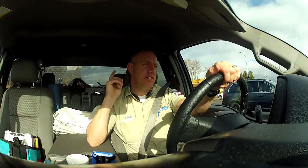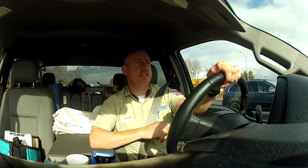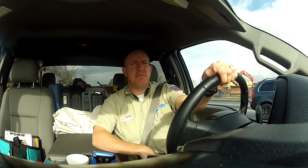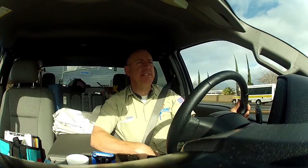I went downstairs and checked his filter and it was caked. So people, change your filters — every month or two, especially in the wintertime, especially in the summertime, change your filters. A dirty filter slows down the air going through the furnace and causes it to heat up, which causes problems on other parts of your system like your heat exchanger. The high temp limit switch will trip because it's too hot, and now you've got a service call just because you didn't change your filter.